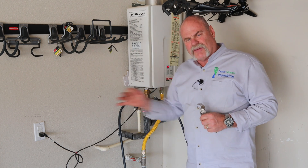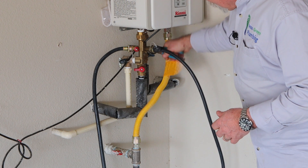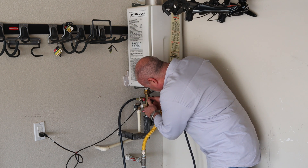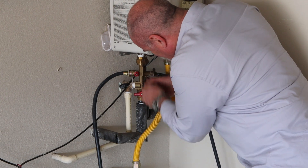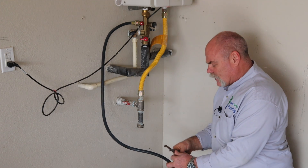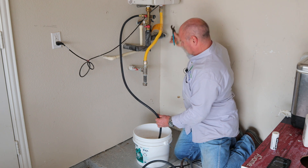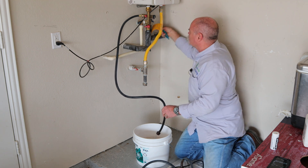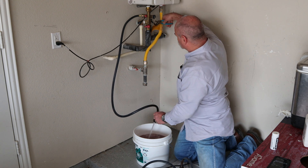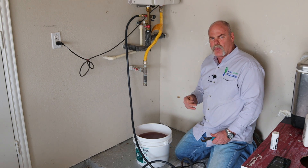Now that we're through circulating, I've unplugged the pump, so there's no chemical going through it. What I'm going to do is shut off the valve on the cold side that lets the chemical in and loosen that hose up, so it'll drain back down into the bucket. Then I'm going to drain the bucket or pour it out so I can flush out the system. I'm going to open up the cold water inlet valve to the water heater so I can flush this out with fresh water — I'll do this three or four times. Then I'll run a pH test on the water just to make sure everything's good.